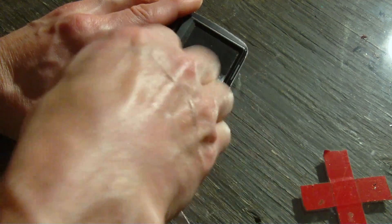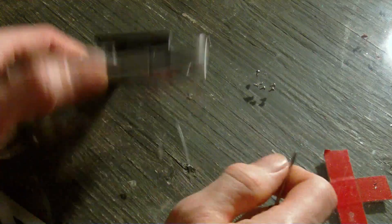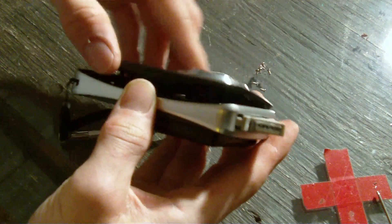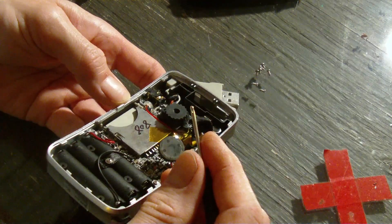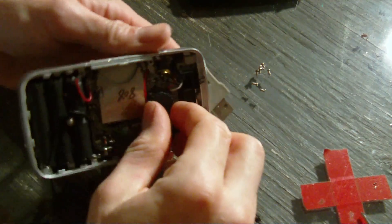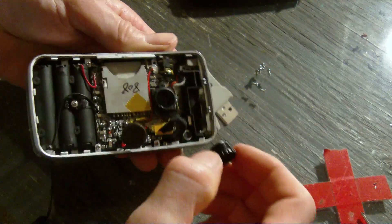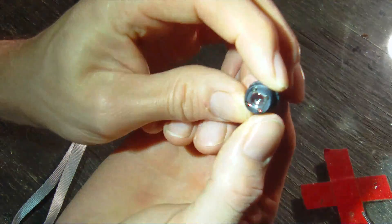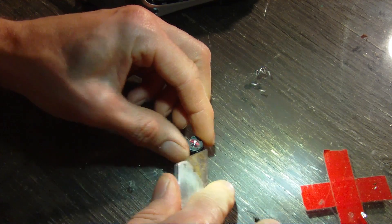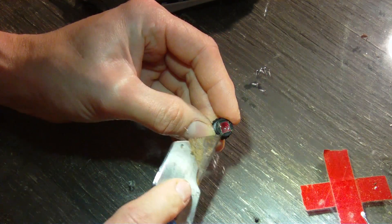What I'm doing is taking the camera apart and I need to get to the IR filter. There's the lens and there's a little threaded-on piece that can focus the lens away from the sensor. So I'm threading out the lens, and underneath the lens, as you can see, there's a little piece of glass. All we have to do is carefully remove that IR filter and pull it out.